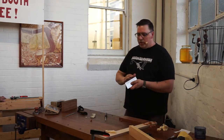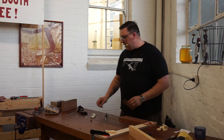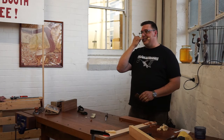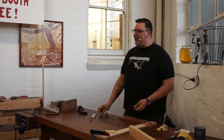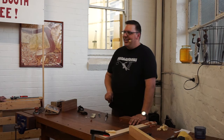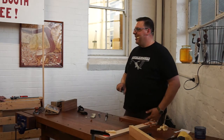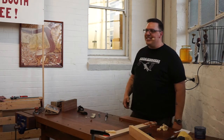Some people like to stone the edge of the scraper on the stone. I only learned that draw filing technique about two months ago, from one of our guys in the shop who's an incredible machinist. He always said, why don't you try it? I was sharpening it on a thousand grit stone and he said, why'd you do that? I said I want a nice polish on the edge. He said, just draw file it. So he showed me how to draw file, and I was like, that's brilliant — I'm never stoning these things again. It works well.